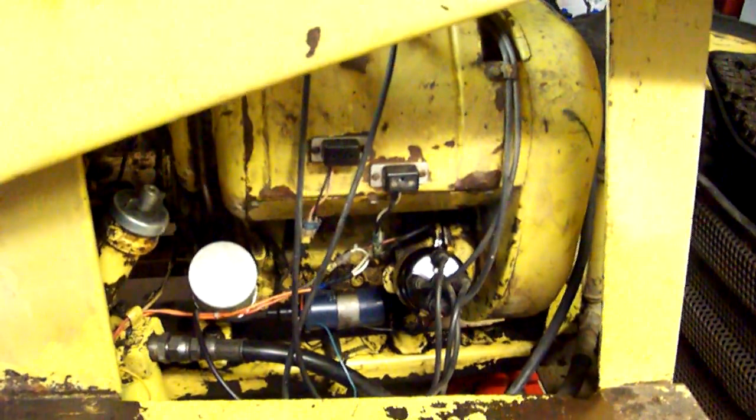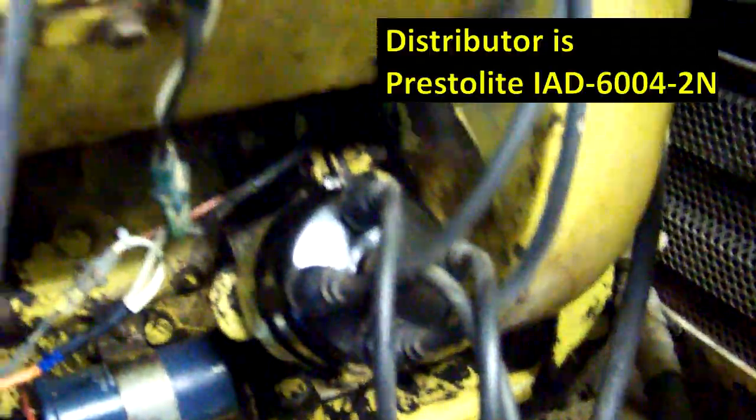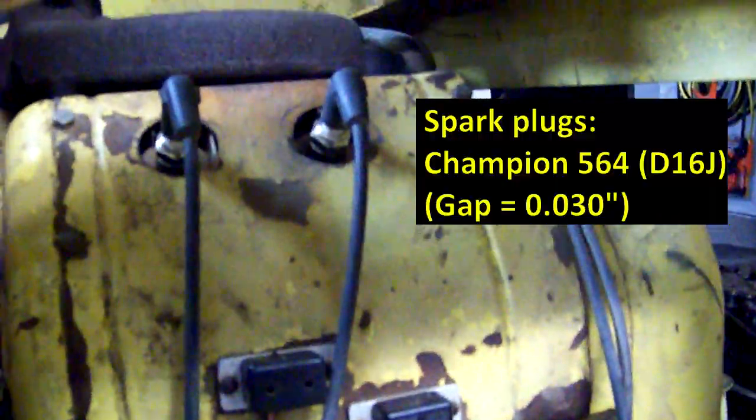This L35 has a Wisconsin engine, and I don't have an alternator. You can see there's my coil. This is the oil filter. This is where you drain the oil. This is the distributor. Two plugs on this side, two plugs on the other. There is a heat sensor on the block, but that's been disconnected by a previous owner. This is the engine oil dipstick. And this here is engine oil refill. This is the fuel tank — I wrote '90 plus octane' on there because it seems to be very finicky about that. I've needed to use starter fluid and choke the engine to start it every time. Over here is the carburetor, the air intake, and this is the fuel line back here.